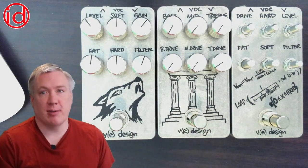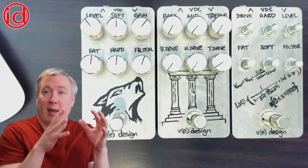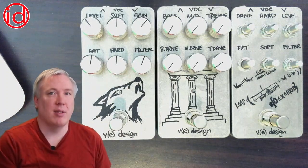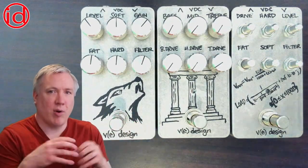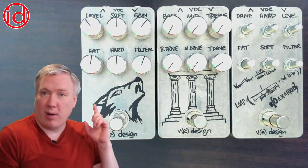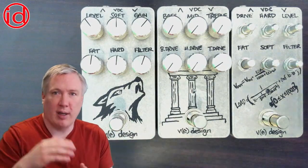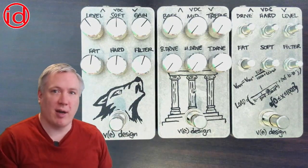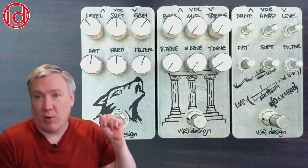In some cases it was natural to utilize a buffer circuit that was essentially already present, and in other cases it just wasn't going to work. Out of all the distortion pedals, the Triumvirate is the only one with a buffered bypass option — all the rest are just true bypass. With the Alpha Dog, one of the main changes was reducing that thermal noise floor, but that actually made it more in line with the specs of the original Pro Co Rat that it was derived from, and it seemed to change the dynamics subtly to make it a little more open than the previous version. The Alpha Dog is one of the few pedals that doesn't take advantage of the charge pump, because its foundational sound is in the distortion of its operational amplifier — increasing that voltage would take that signature sound away.